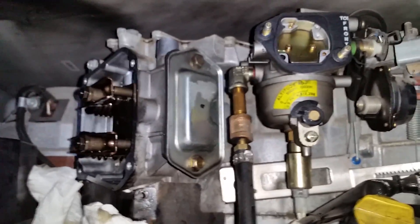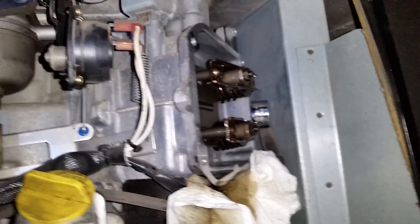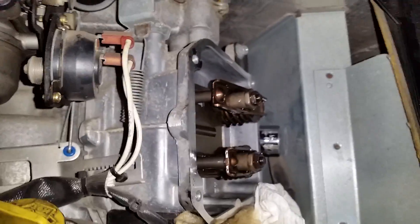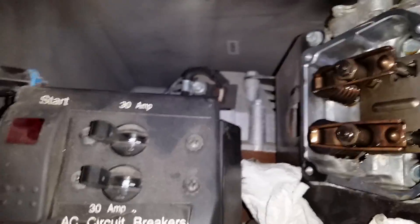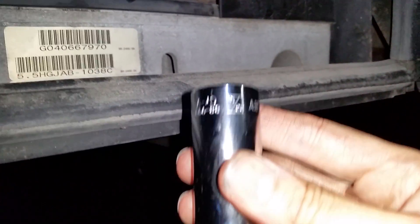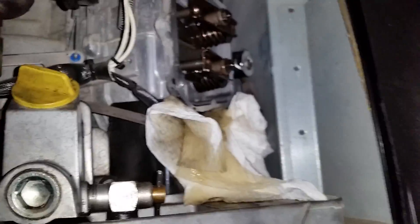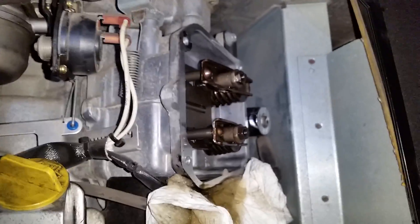The valves are all adjusted and everything's in good shape. Now I'm just waiting on my new gaskets to arrive and I'll put it back together. I'm leaving the spark plugs out just in case someone tries to start the generator — you sure don't want that to happen and blow oil all over the place. For this tight side spark plug, it takes a 13/16" socket on a 3/8" drive, but you don't have room for a ratchet, so once you get the socket on, use a pair of channel locks to break it loose — comes out just fine.